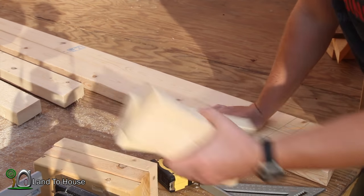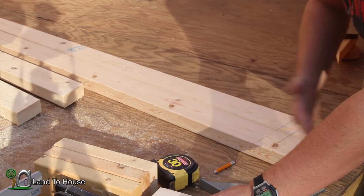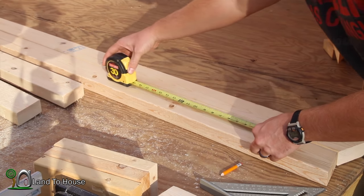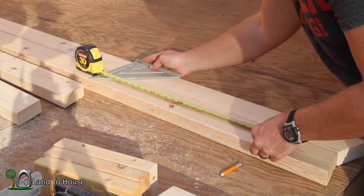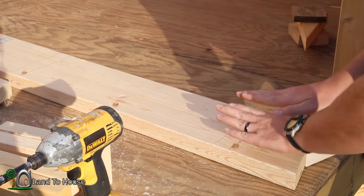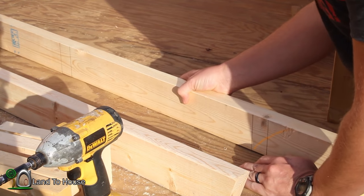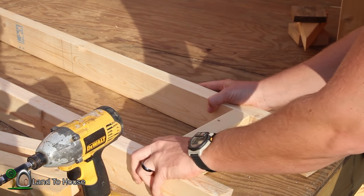I've only got five of these per ladder because there's not going to be tons of weight on here and it's not really going to attach to anything on the other side. I'm going to come through here and install these every two feet. I decided I'm only using four along here because on the end there'll be that end board — the sub fascia — so it'll have plenty of support. Now I'm going to come through here and line these up and get these screwed into position.